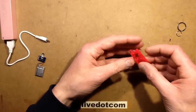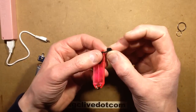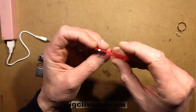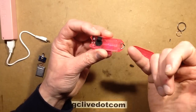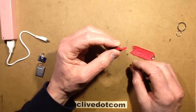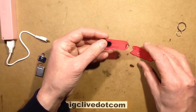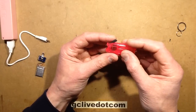Looking at the case, it's got a little rubber seal — I'd call it more of a dust cover — that just shoves into the micro USB port to protect it from dust ingress. The button will have some sealing I suppose, but the rest of it is really just relying on a lip that sits together. There are so many orifices that water could get in; if you drop this in water, surface tension is about the only thing keeping water out. With any thermal expansion and contraction it would just suck water in. In that case, it would probably be better to take the little rubber bung out and put it in a warm place to dry out.